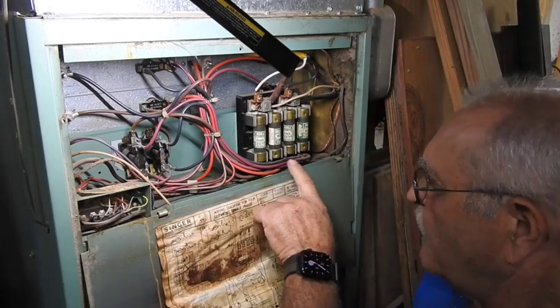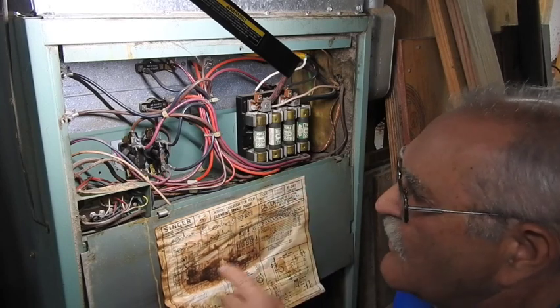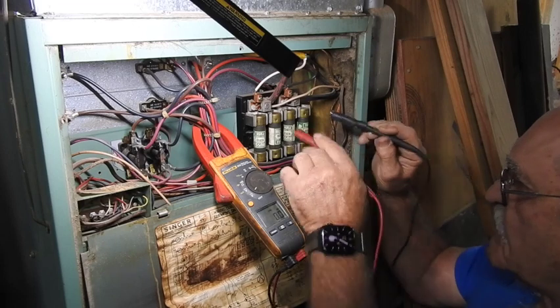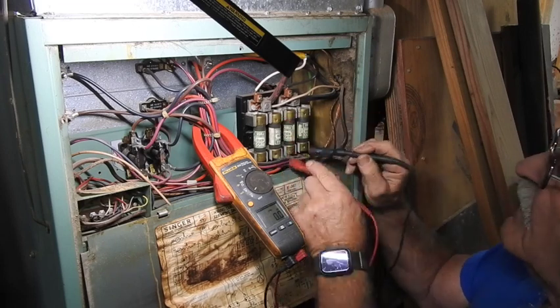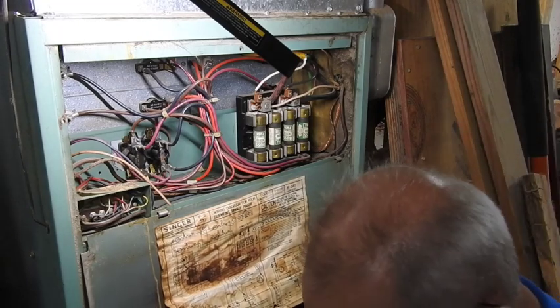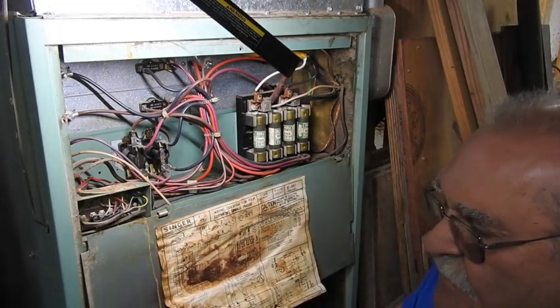So that's the whole issue, and that's what we're going to do right now. I pulled the power, but I'm going to go ahead and double-check that the power is off, and we're going to pull that sequencer out. I'll just hang that there and check incoming power. Apparently I got the right breaker, so the incoming power is dead. This here is the replacement sequencer.